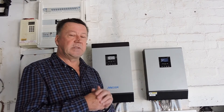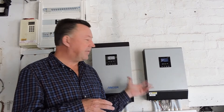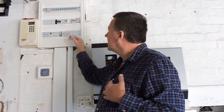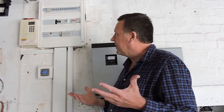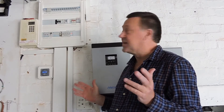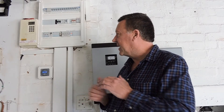I'm replacing a 10kW system with a 5kW system because I will have more flexibility of management. One thing with these kind of hybrid inverters is they're difficult to manage as a user profile. I also completely rewired my distribution board — all new Hager kit — and I've installed various contactors and timers to manage things like my pool pumps. I've even installed light-sensing equipment so that my pool pump doesn't come on during a cloudy day. But trying to manage your whole solar environment with all these bespoke pieces makes it very complicated, and if you go on holiday it's almost impossible to explain how everything works. I have fitted a bypass switch so if anything goes wrong with the solar you can flip back to utility — a one-switch-over solution in case of any error.